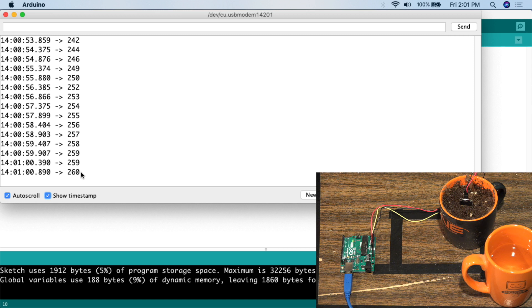That's something to think about if you're doing an automatic watering project. I would have the sensor check the value every 10 minutes or so. If the value is below the target level, turn the pump on, pump water into the plant, and then wait 10 minutes before determining whether more water is needed. Because as you can see, it takes time to stabilize — if you just keep pumping water in, you may run into issues with the variable values.